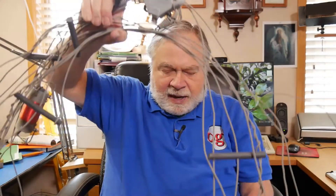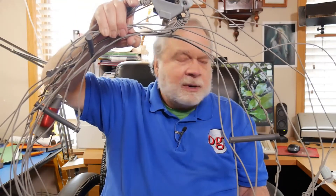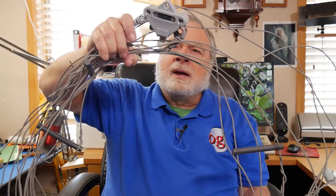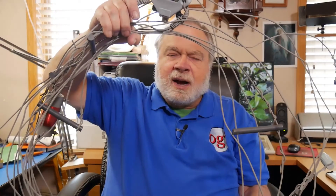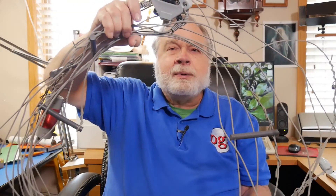It's kind of pricey but built like a Sherman tank — very, very sturdy. It is only 40 feet long and yet it will cover 40 meters, with nice gray wire that's hard to see. It can be set up as an inverted-V even only 20 feet high, making it a great antenna in some HOAs that allow limited antennas. I considered this as the reference station antenna, but because it only covered part of 40 meters it was not selected. Still a fine antenna, and this will be giveaway number four.